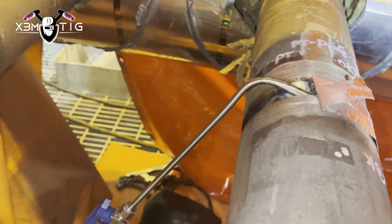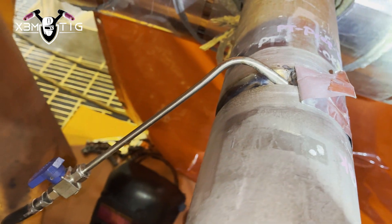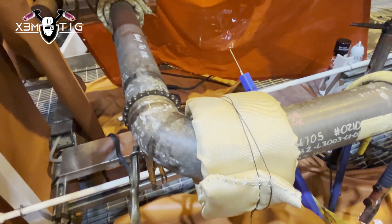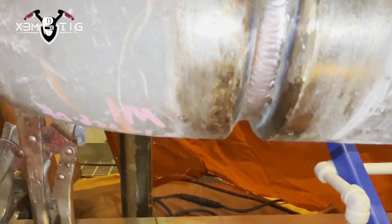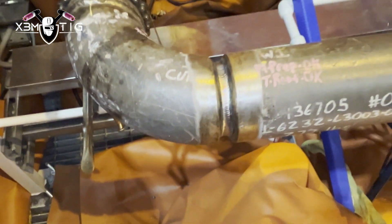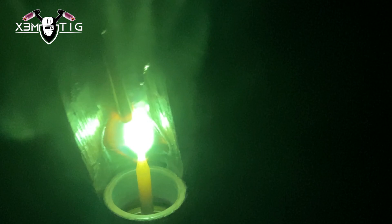I'm going to focus on the other joint — as I said, I've got two joints and I have to do both at the same time as it's a closure weld procedure. QC will check that everything is good, I'll close it up, and then it's got to be filled. For post-weld, you put heat blankets on to keep the temperature up — the weld has to be slowly cooled down, no rapid cool-down, not exposed to environment. Wrap it in a heat blanket for slow cooling.